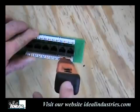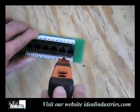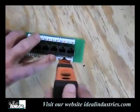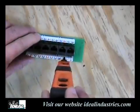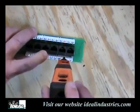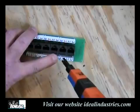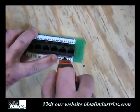And when I say lean it into the cutting edge, I'm talking a couple degrees here, not 45 degrees, because, again, all this is a piece of plastic that we can tear up in the process of terminating. And you really can't punch these down and rip the wires out, and punch it down and rip the wires out a whole bunch of times before it really becomes ruined. And over the years, I've started categorizing people. There are people I call the rapid fire people.